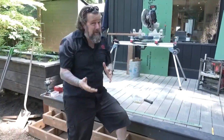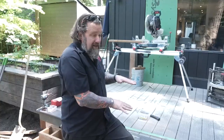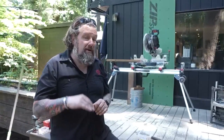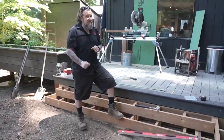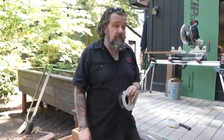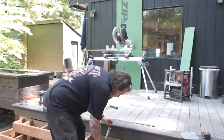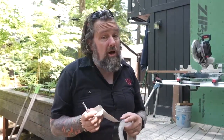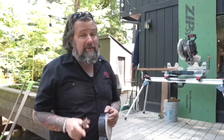I'm building this a little bit backwards, and here's why: I'm going to be putting in a paver patio down here later this month, but I want these steps built first so I know where that finished level is going to be. That way I can figure out any issues right now. So I'm building it backwards by putting the top step in and shimming it up with blocks — that way it'll be finished and I'll know where my finished level is for that block. Now here's a secret for any deck project: deck tape. A lot of different companies make it. This waterproofing goes on top of each one of these framing pieces. It waterproofs the whole top surface, which is really where your deck frame rots out. Every screw hole is an invitation for water. This seals it off and will double the lifespan of that deck framing, meaning it might last as long as the decking itself.